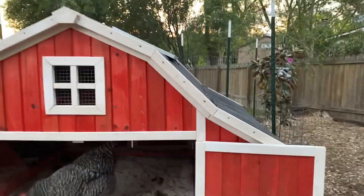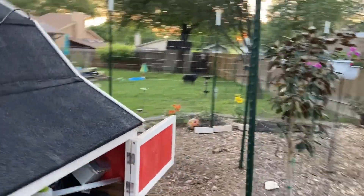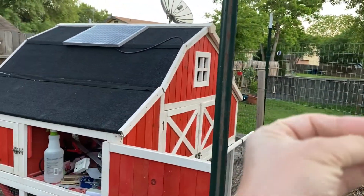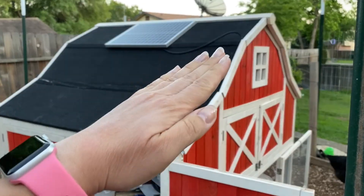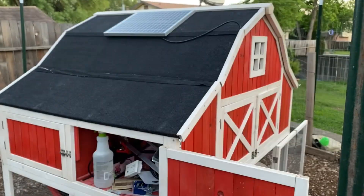What we're going to do is have a fan on the opposite window on the inside. And if you didn't know, fans can go two different ways. The blades are angled — there's one way that draws the hot air and sucks air out, and there's one way that sucks air from the other direction and would bring it in. As hot air rises, the hottest air is going to be up top, so that fan is going to be getting it out of there.